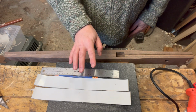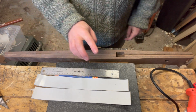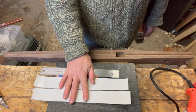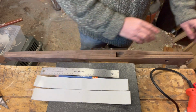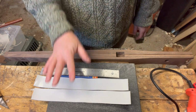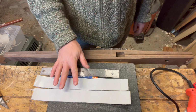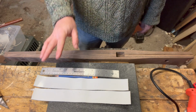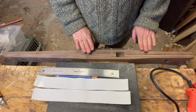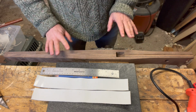So what we'll do first is we'll measure the major chunks of the inlay, and we'll cut the PVC as we have it now. We'll cut chunks to size, and then we'll continue the heating and flattening process, which will be much easier, like I said, because they're going to be smaller pieces. So I'll just show you now the layout lines that I've created on the top of this tiller, to give you an idea as to the pattern that I'm looking for.